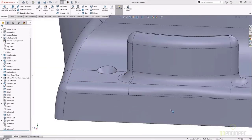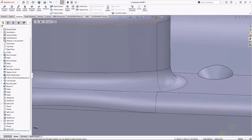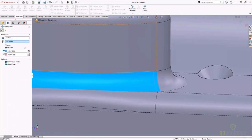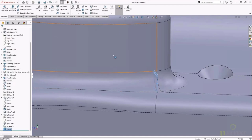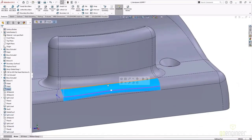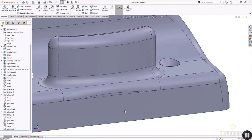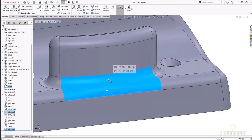On the other side, I use the same face curve to reference plane procedure to break up the face. So I've got my spline, create the reference plane, then split the face. Now I've got my split faces for where I want to change this blend. I have all of the faces I want to get rid of and change, so now I'm ready to use the Delete Face command to delete them.